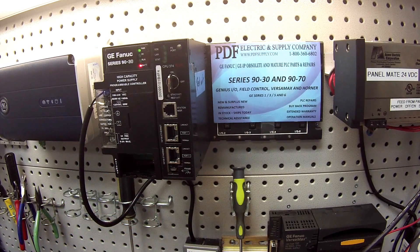The third way to check if the battery is working is to go into Proficy Machine Edition, go to your top menu bar, select Target, and go down to Diagnostics toward the bottom. Click on Diagnostics and your Info Viewer will open up a fault table, which will show you if there's a low battery signal. So those are three ways you can test this battery.